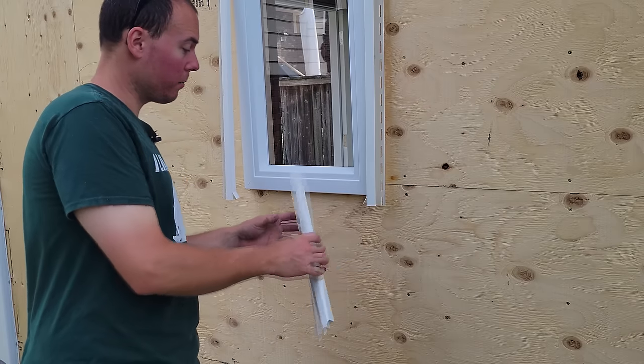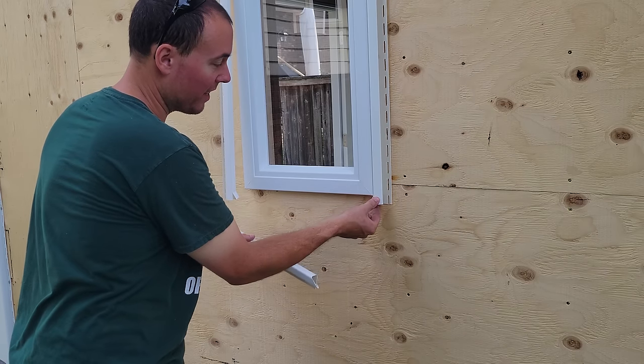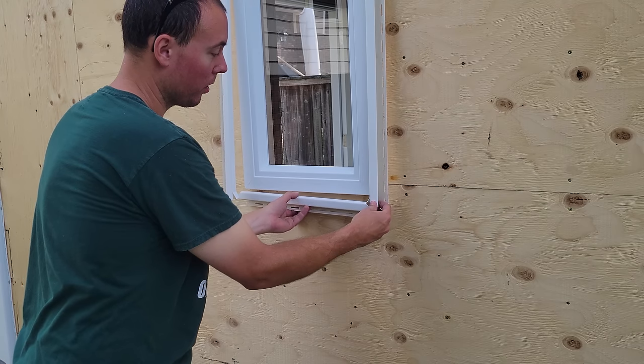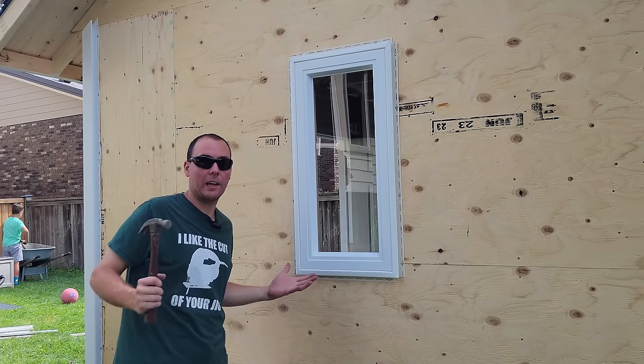So to finish off the bottom, we have this piece right here, which just has our 45s and a flat cut on the back. That's because the bottom rain tab is going to fold behind on the bottom piece here, and then we'll overlap our miters. Ta-da!